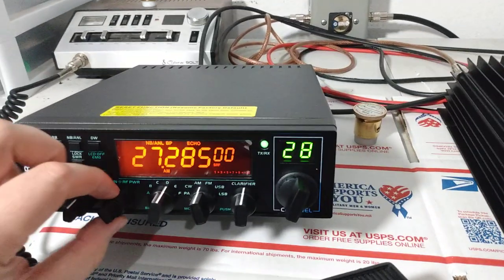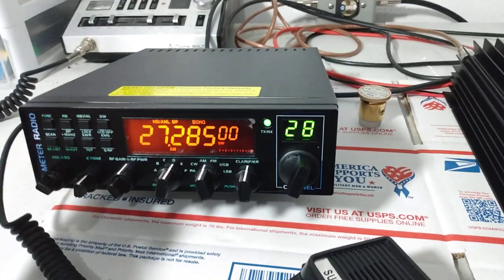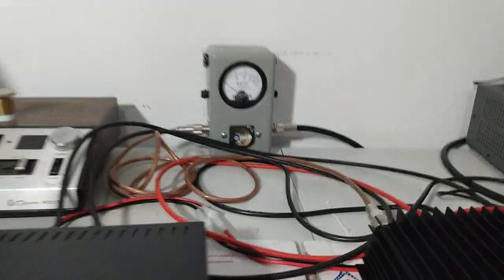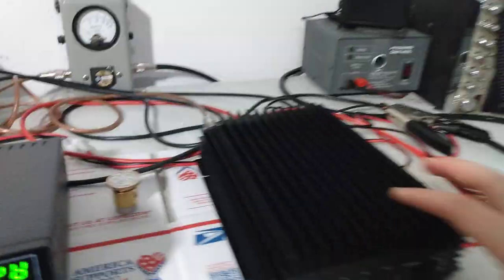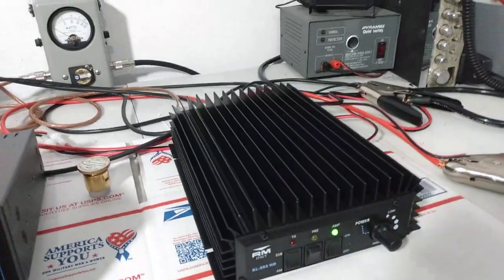So almost 4 amps. So you know the radio is doing some really good power wide open. So let's just turn it back, a happy medium there to start our sideband test. We'll leave the 1000 watt slug in, turn the amplifier back on, go to sideband mode.